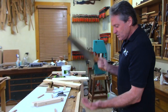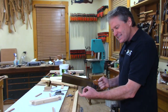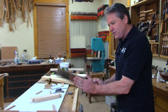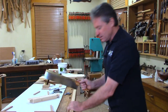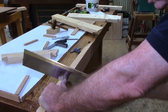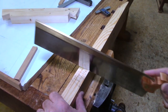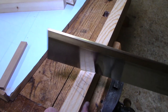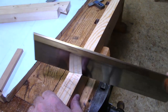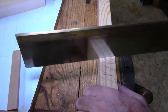Long story short — I'm going to use this crosscut saw to cut out the waste. Because I'm cutting across the fibers, it's ideal. It's a little rougher to get started than the dovetail saw for some reason, and it has a little more set on the saw — a little more flare to the teeth. But it saws so beautifully. I'm very light with it — like playing a very subtle note on the violin.